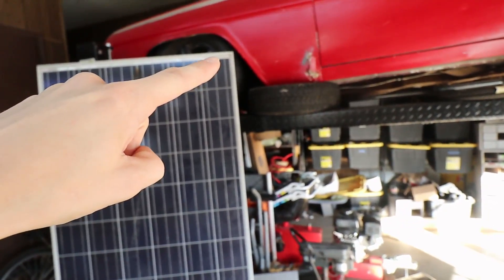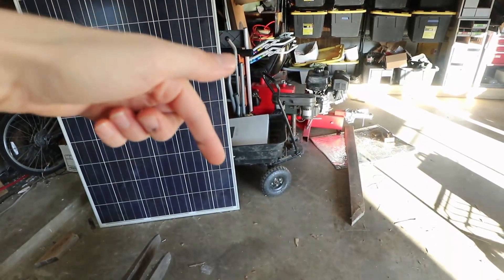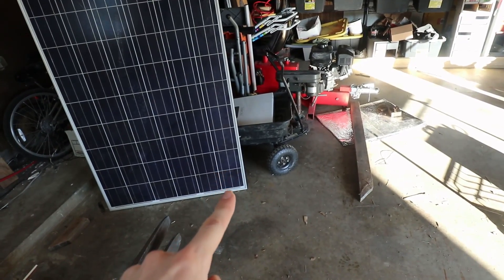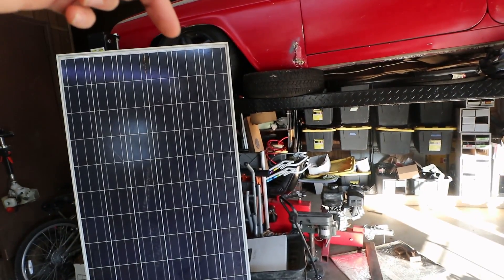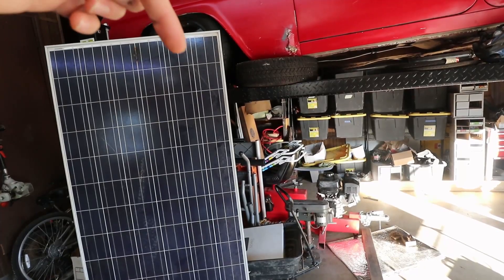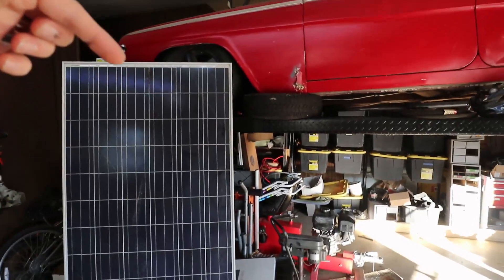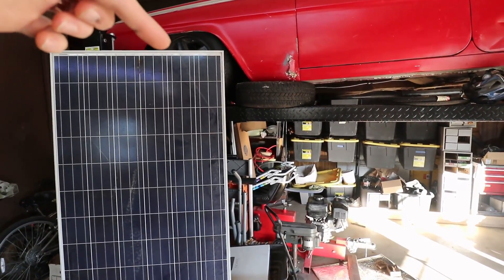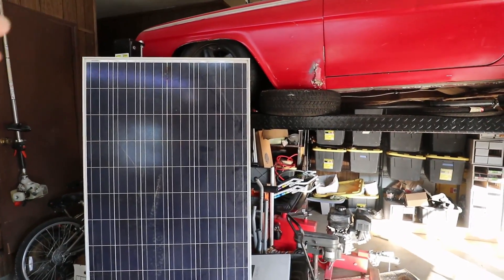So I thought: it's just a bunch of cells in series. The way these are set up, you have bypass diodes up in the junction box. The current runs all the way down — these are all cells in series, each one is a cell — then all the way back up and hits a tab where you have a bypass diode running between this row and that row. Then it comes all the way back down, all the way back up again, another bypass diode tab, then all the way down and back up to the other MC4 connector.